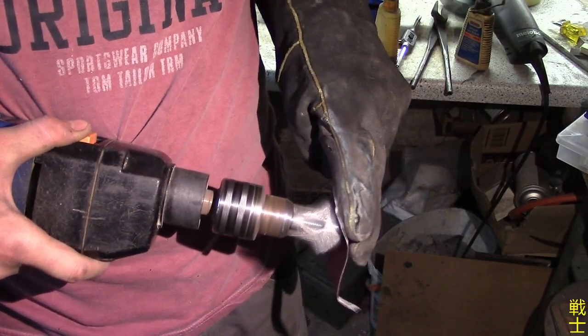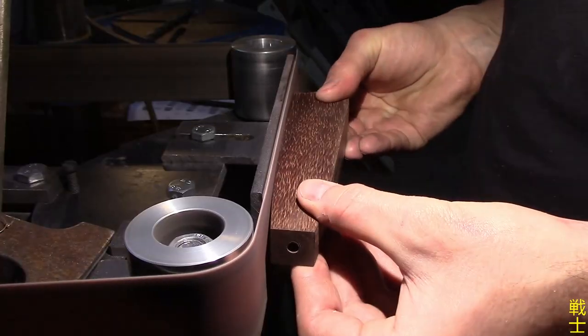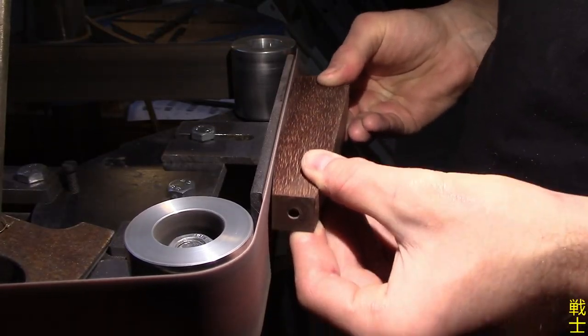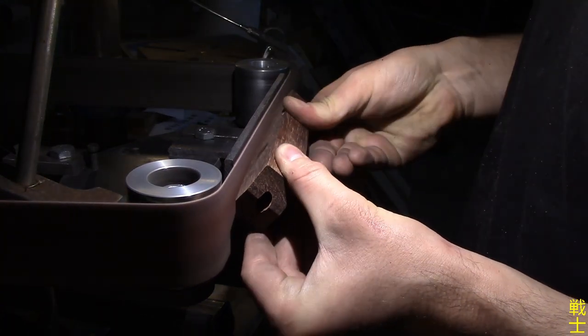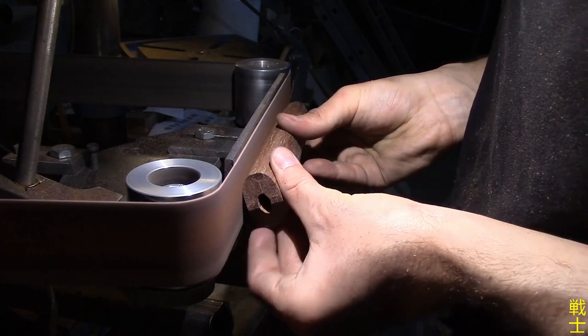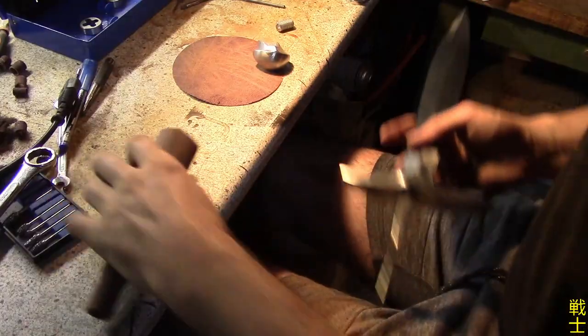After a little bit of finger-defying sanding in my makeshift lathe, I routed over the handle and made sure the handle fitted inside the pommel. I also made a little M10 nut to tighten everything down and screw the pommel on.